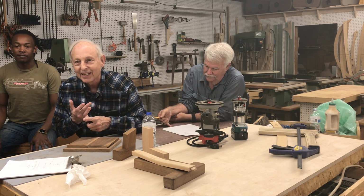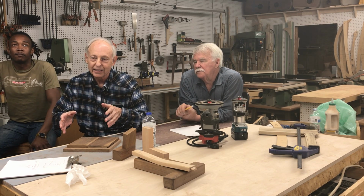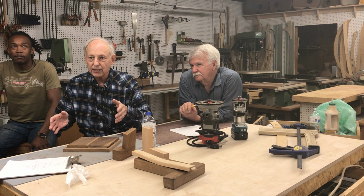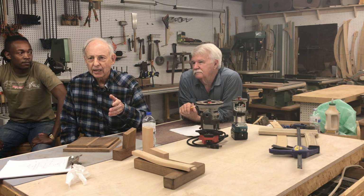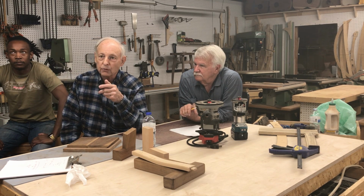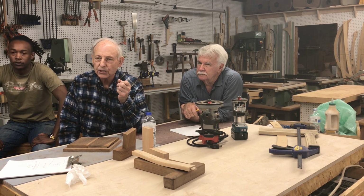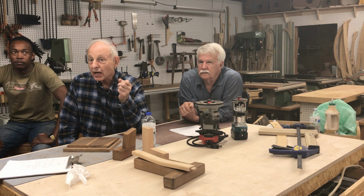Take your choice. It's gonna burn. They're not made to do that. The track saw though, the big Festool track saw will go about 2 1/4 inches thick. And they make clamps for the track where you can feel secure that it's not gonna move. Yeah. And you could literally rip 2-inch oak or 1 3/4 oak with that track saw and not have a problem with it. Now, can you do dado cuts with it?